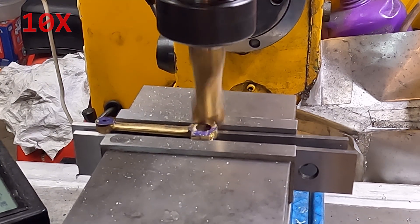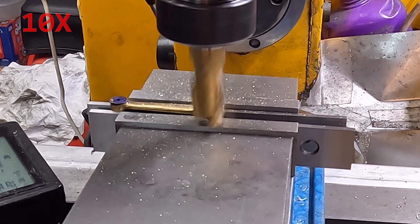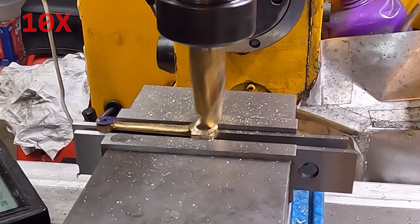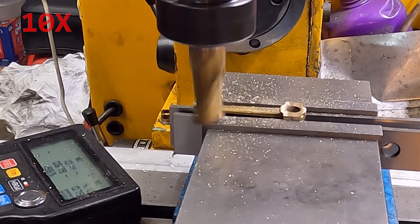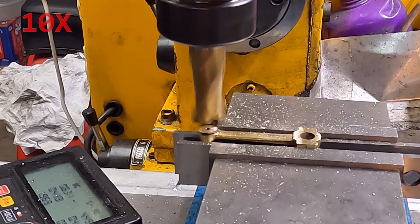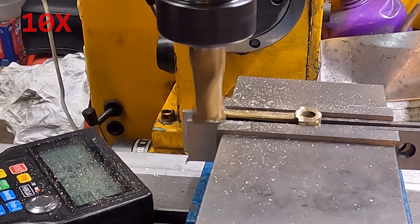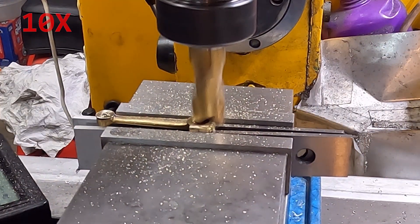Welcome back to my build diary. The original owner of the kit completed the conrod for the most part, but the opposite sides are not quite parallel and somewhat narrower. We've compensated for the width already, but I want to level out the two sides. I found the good side on the surface plate and I'm just doing very light cuts on the other side to level it up.